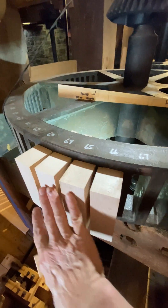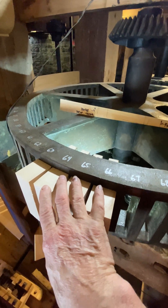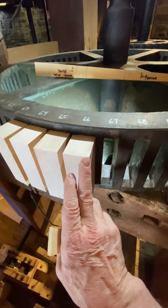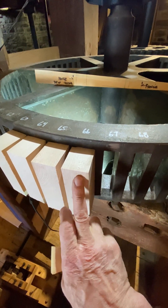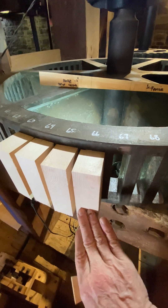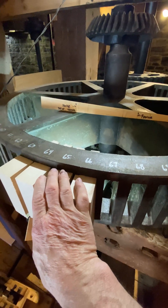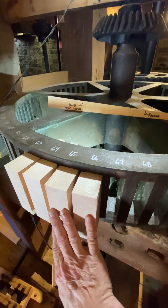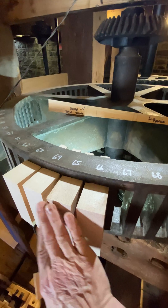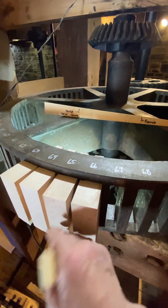These are a little longer. The reason I did the teeth in this way is — you can remember I said that this is air-dried to about 12% to 15% moisture — I wanted to leave the last cut to be end-grain, because I don't want any checking in here. Any checking in these from drying will cause weakness in the tooth. These will be soaked in a paraffin type of lubrication that displaces the water, so they'll never change in shape.